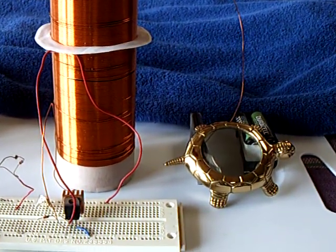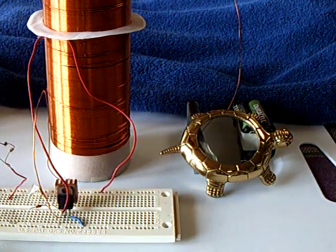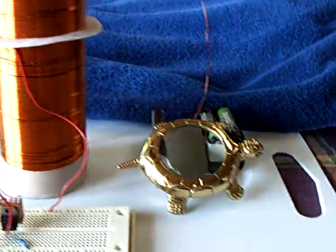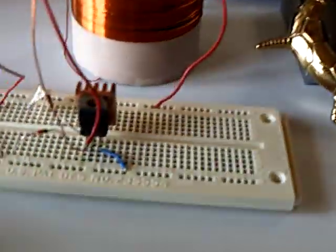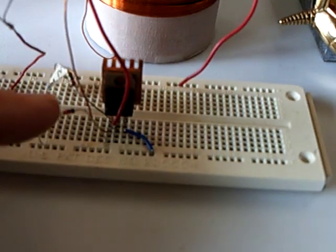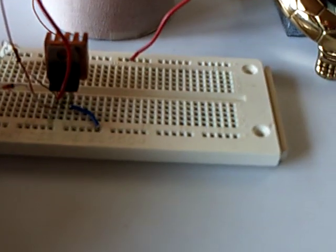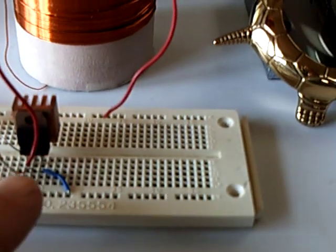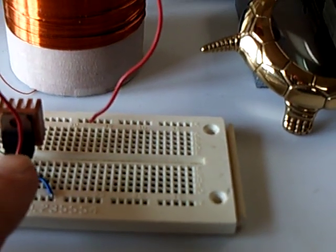Johnny was the one who first showed it, and I tried and tried but couldn't get it to work. I got the wrong coil here — this coil isn't right, I'm going to have to wind another one. But I got it to work by adding this diode that Whoopi showed, from the base to the negative rail, and I'm using a TIP-3055.